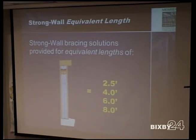So we've got those available anywhere from 12 inches. No, the narrowest you can go prescriptively is 16 inches with PFH method or CSPF method. Either one of those you can get down to 16 inches. But sometimes you do have less than 16 inches, especially at garages. A lot of guys only have 12 inches, some may only have 9. If you have 9, you're SOL altogether, unless an engineer can really come up with something, because there's no manufactured wall out there that goes under 12 inches. There are some walls out there that are 12 inches. Ours is 12 inches and actually comes with the stud.